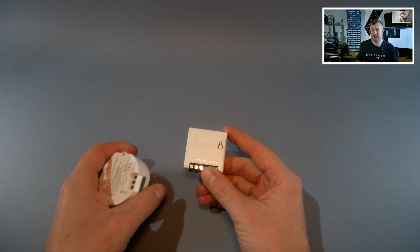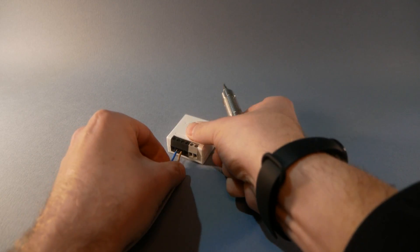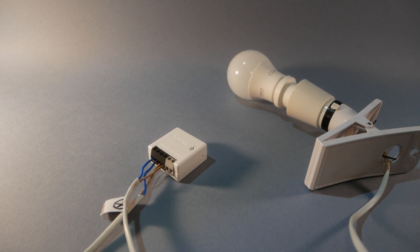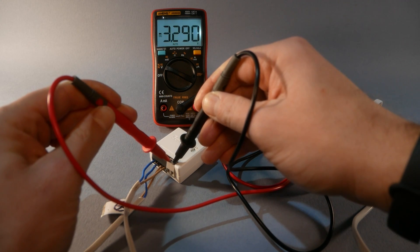This is not the first time I've had a Zigbee switch in my hands — I've talked about a semi-smart Zigbee switch in a previous video, but this Sonoff Zigbee Mini is much smaller. It features single gang operation and fewer hardware issues. Just like the Sonoff Mini, you'll find six terminals to connect your wires: two terminals for live and neutral to power up the device, two additional terminals to connect the loop for leading energy to a light bulb, and separate — this time gray colored — terminals for the switch. Bear in mind the switch uses 3.3-volt logic, so do not connect mains electricity to it or you will destroy the device.